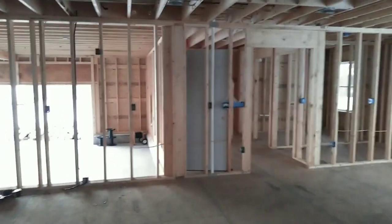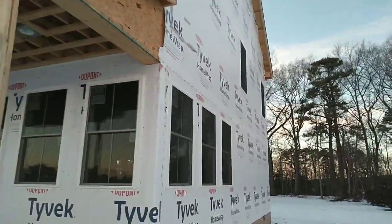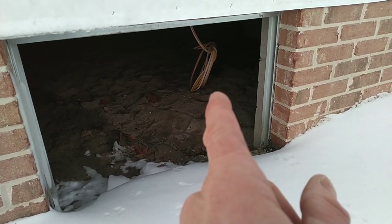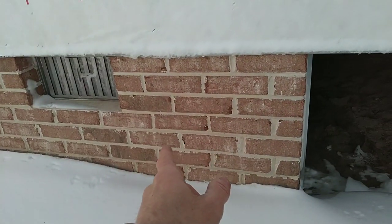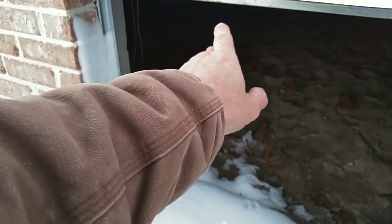We're going to do a walk around outside the house. There's a crawl space egress. This house has a sewer alarm and a sewer pump — they couldn't tell me the location, so the wires are hanging. On this side, the post lamp wire comes out under the ground — already trenched that in. On this side of the crawl door, thermostat wire is hanging for the doorbell transformer. The surface light and surface outlet are going to be right here, and somewhere in this area the well company will hook up the expansion tank.